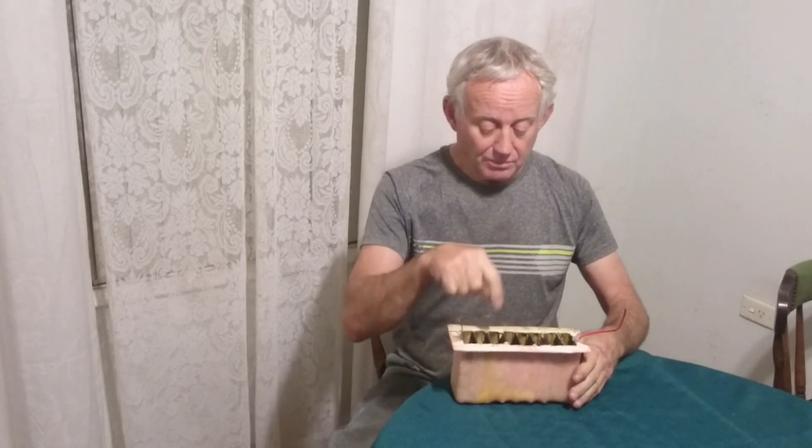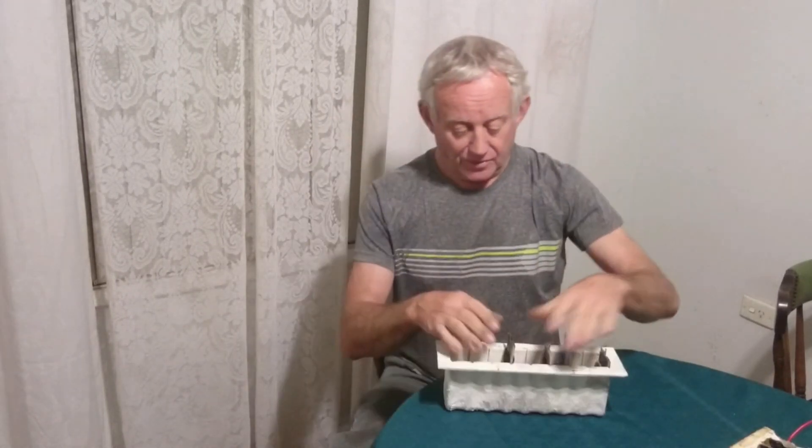I've done other experiments. This is fiberglass — each one of these is HDPE with carbon felt on the side. Originally it was all full of oasis foam separating it. I thought that would charge it up and keep the bromide separated along the length of electrode. However, when you charge it up, air bubbles form inside the oasis foam, they can't rise to the top, so it pushes liquid out and it boils out. It even burnt the positive lead and I had to replace it. I've also tried plates sliding out with different electrodes and different separators. That didn't work either.